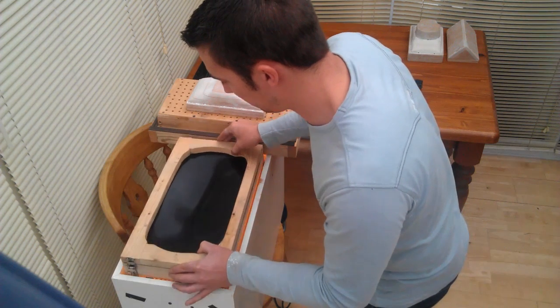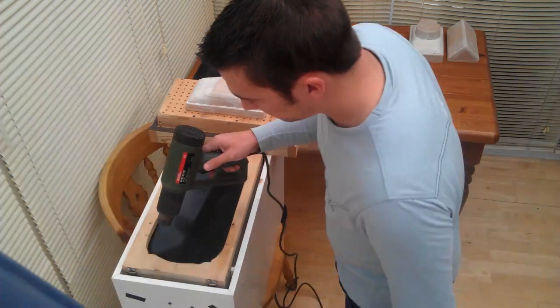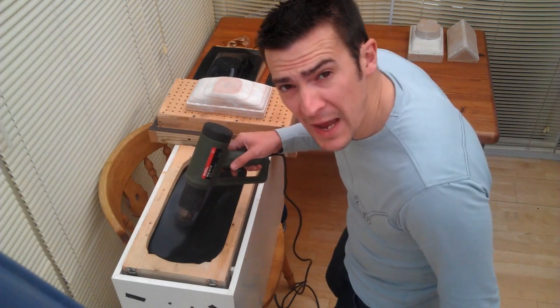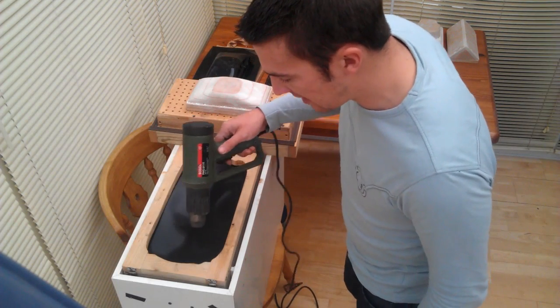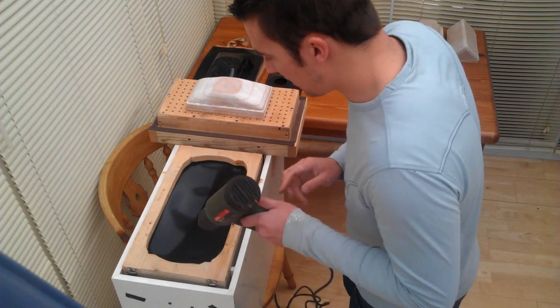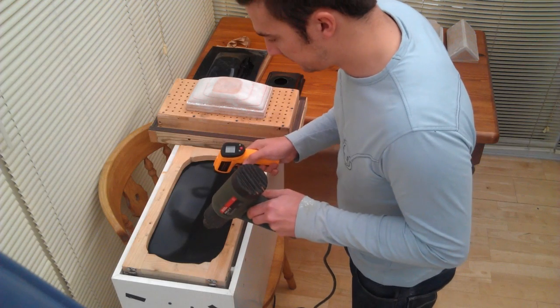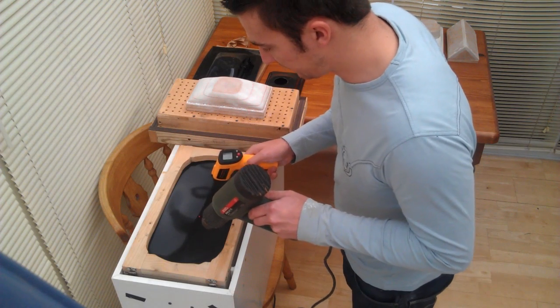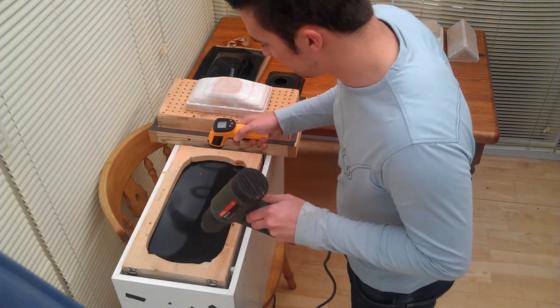See the plastic is getting floppy already. I think this is PETG plastic but you can use ABS — they all have slightly different melting temperatures. This seems to go soft at about 150 degrees. That's 160 in the middle but only 130 around the edges.